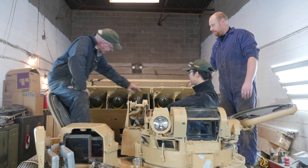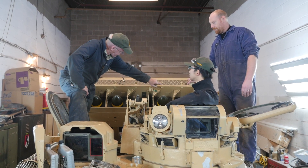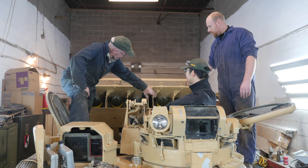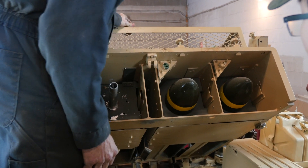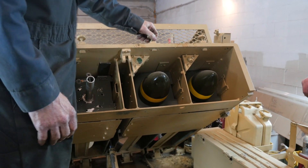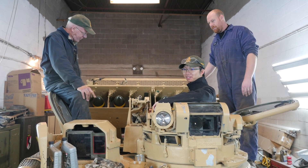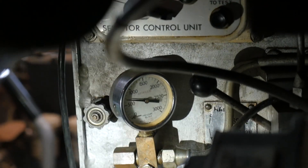There's another electrical connection on the front to the MS3 — one for each side. And swing fins, right? Three pins to rotate the connector — we're not sure what that was before, so if any of our viewers know, let us know in the comments below. The manual hydraulic pump was used to pump it up and it worked very well — about 900 PSI, going between 500 and 1,000 to raise it.